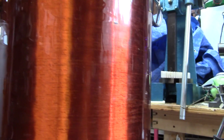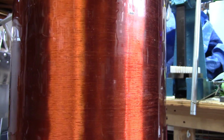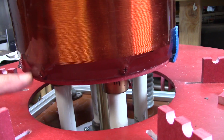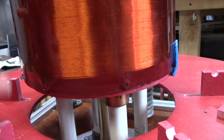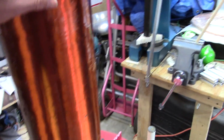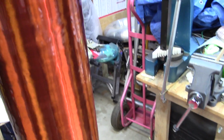That's from prior maladjustment of the altitude here. If I had this thing lower, the coupling would be tighter, and I'd get racing arcs. There are a lot of theories about what causes racing arcs. I have my own theory, which is that they're standing waves of inappropriate frequency. It builds up voltages around here that arc out amongst itself.